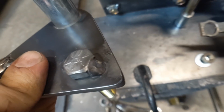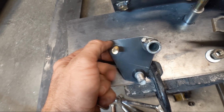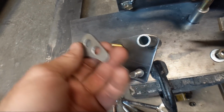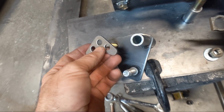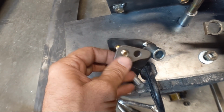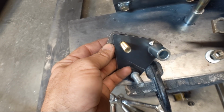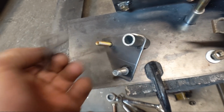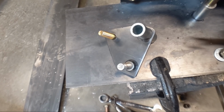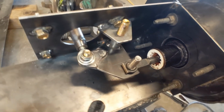So I'm going to have to cut these little welds and pop this piece out. And then it's going to be close to the edge, and so to add a little bit of support, I've got these little 90-degree gussets, and they happen to be 3/8 already. So I'll probably do one on each side here to reinforce it, and then send that bolt back through and weld the whole thing back up. So better get started. All right, this is how it's looking now.